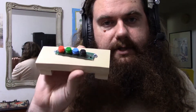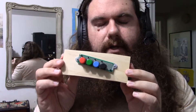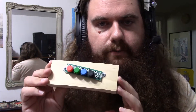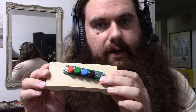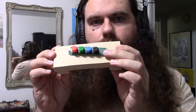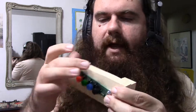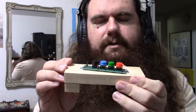We'll begin with the first one I made, which is buttons. The idea is you have four buttons mounted on a board, nice and easy to press, and it settles on the table — which is great because while these buttons do fit in a breadboard, they don't fit easily and are fairly likely to rip apart the holes. This ends up being something like a common cathode or common anode setup. You have one pin that's your input or output, your power — positive or negative — and then there are four pins, one for each button, color-coded. Just hooking up wires, you now have quick and easy button inputs.